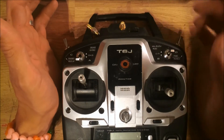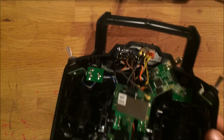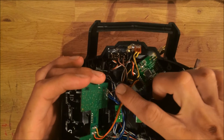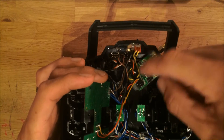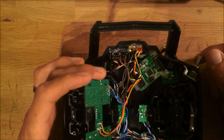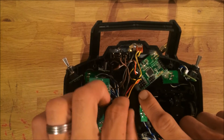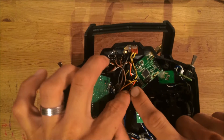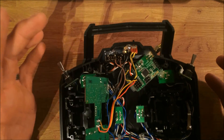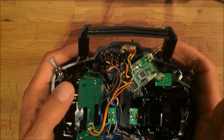You should of course turn your transmitter off when switching between the two, but it's very easy to do. I cut the ground cable, ran it into the switch. The blue wire connects to one of the pins on the switch, and the other pin on the switch goes to where the ground should connect on my LRS unit. That's pretty easy if you just know the pin outs — they're available on the web and pretty easy to find.